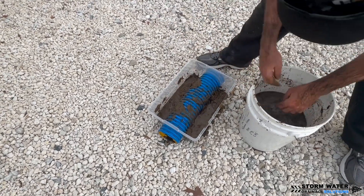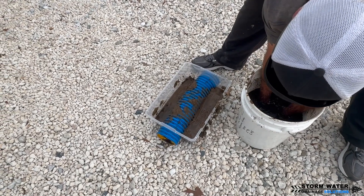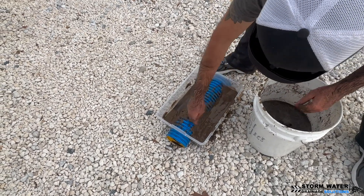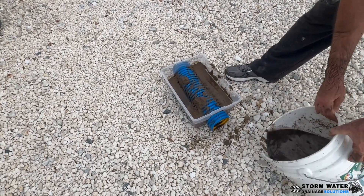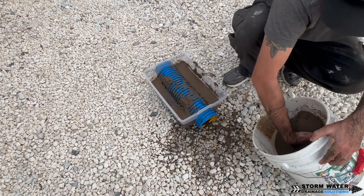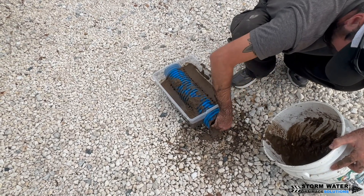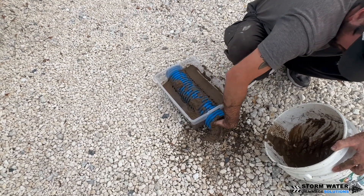The last video that I did — I'll go ahead and link in the description below in case you're interested — the point of that video is trying to show that corrugated pipe is going to move water a lot more efficiently in a French drain opposed to a PVC perforated pipe, because PVC only has holes on the bottom. And once those holes get covered and packed in with sediment, water can no longer enter that pipe. The difference with corrugated pipe, which I'm trying to demonstrate in these videos, is that corrugated pipe has perforations 360 degrees around the entire pipe, meaning water can still find its way in even if there is sediment gathered at the bottom of the pipe that has blocked some of the perforations. So you are still able to continue to move water in your French drain if sections of the pipe have been compromised with silt and sediment.